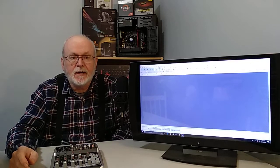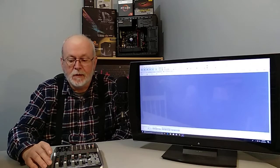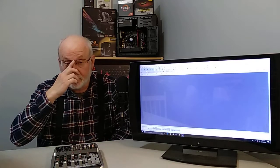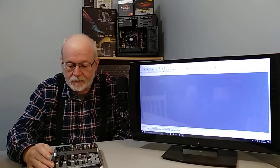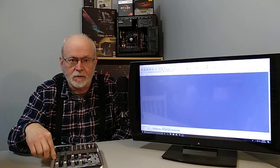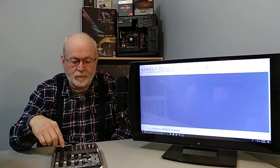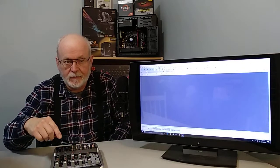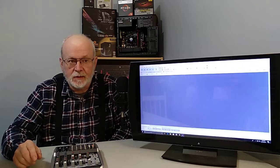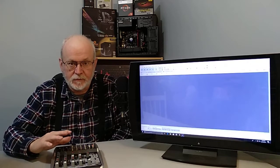This is Murray from Second Time Tech, and today I'm going to show you how to use the mixer that I have powered up, and how to adjust the channel so that you're not getting any distortion, and also the proper line level out. Line level is 0 dB, which means that it is 1 volt of audio coming out of your mixer,